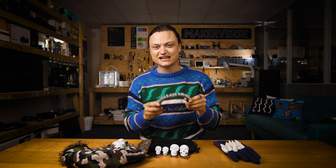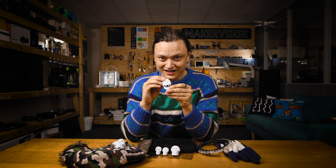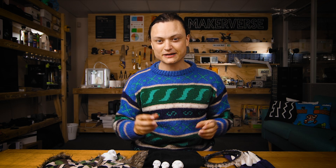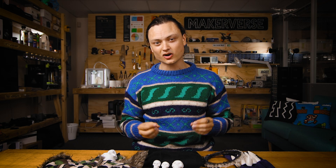You can also create neat little moving models like this skull right here, which will have a jaw which is free to open and close. Also, if you're taking a more engineering focus, you could improve material properties of 3D printed components by embedding certain fabrics like Kevlar or carbon fibre into your components with multiple layers, which would improve the strength of the piece in the direction of the fabric fibres.